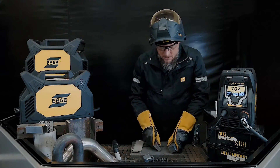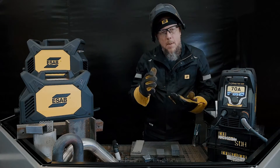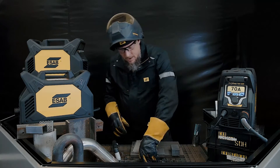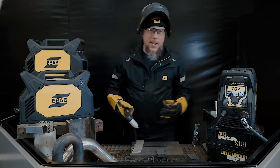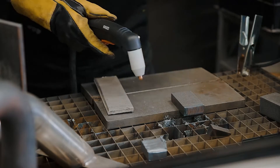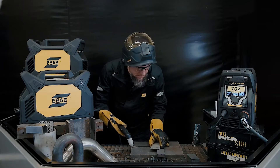If I were to cut different materials like stainless or aluminum, I'm going to slow that travel speed down about 15% and typically reduce the cut thickness capability by about the same 15 to 20%. So cutting really thick stainless, I'd have to reduce that thickness. Let me do a hole — piercing a hole is not difficult, especially with the 70, it's such a powerful machine. I want to set the torch at a slight angle and come down into vertical. Let's pierce a hole in this material.